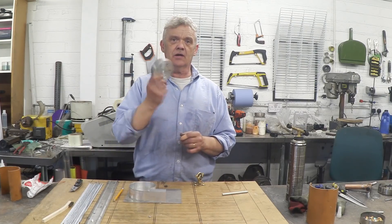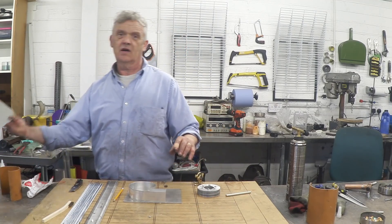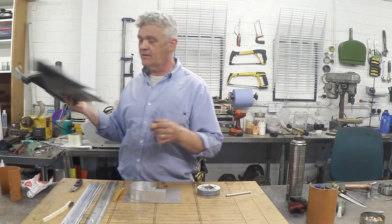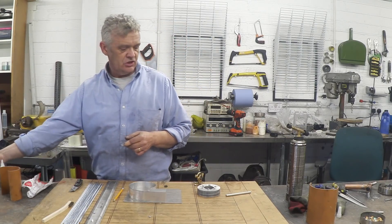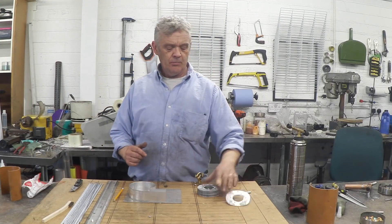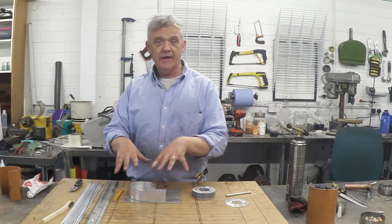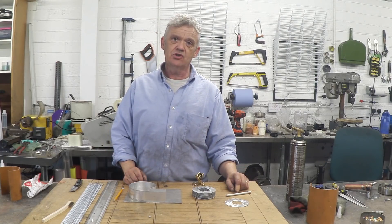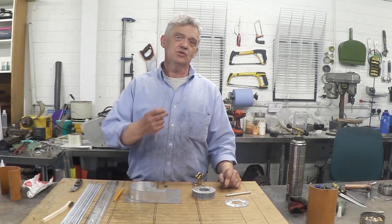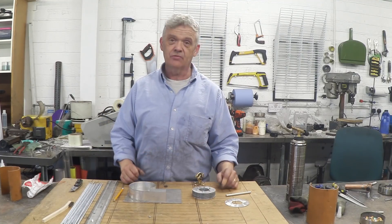So I've knocked together a quick rotor. The rotor's really easy, actually, because I have a lot of this stuff lying around. This is sheet aluminium used for roofing and window surrounds — dead easily cut, nice and light, thin gauge. So I cut myself ten like that, bolt them together on a backing plate, and that is my rotor. I plan on putting it on the involute case to see how this will do as a wind generator. Anyway, with all that aside, it also gives me an excellent excuse to try one of these.